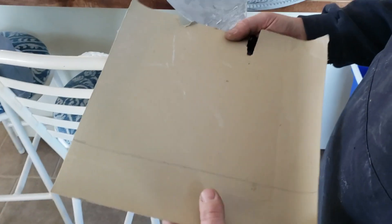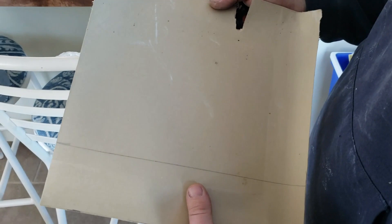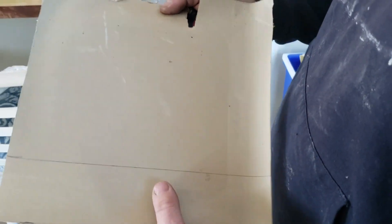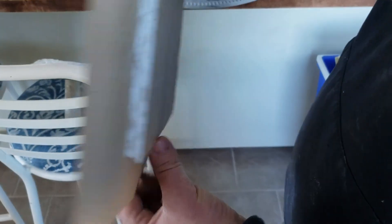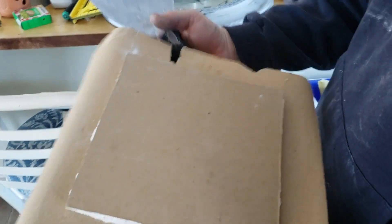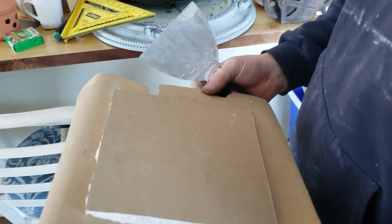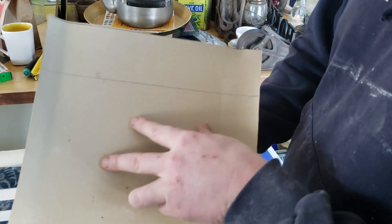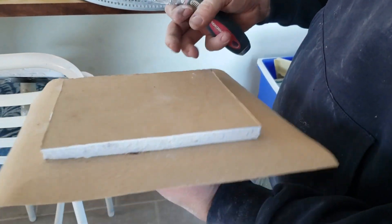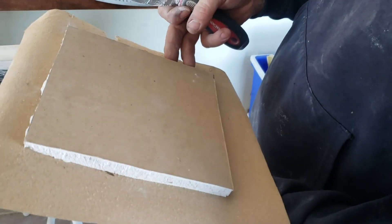What I did — in case you can't see it very well — it's a 12-inch square piece of drywall, the hole is eight inches square, and if you flip it over, I've cut the back of the drywall two inches smaller all the way around to leave me with an eight-inch square. This works well if you don't have anything to fasten the drywall to.